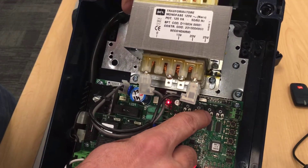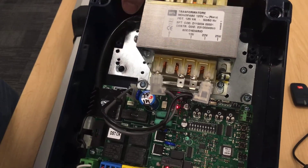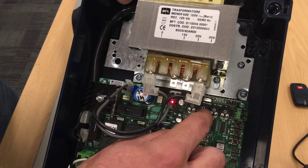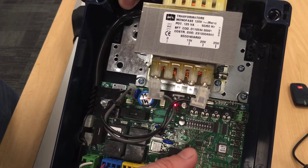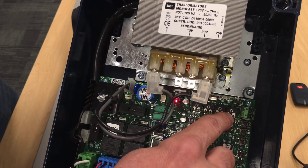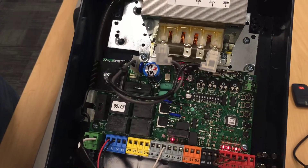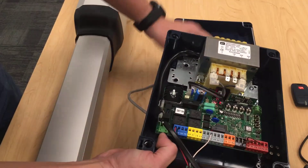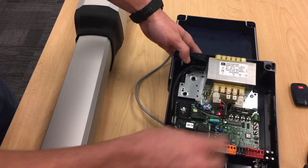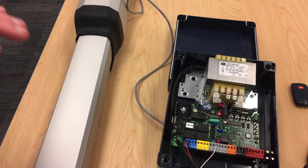Potentiometer number three is your slowdown distance. I normally have this all the way off — counterclockwise — to make your slowdown distance the shortest. Potentiometer T4 is how you go between leaf delay or making it one motor. If you just want to use one motor, like our demo, T4 is all the way off. If you want to use two motors, you would turn T4 up to at least 9 o'clock. If you have it below 9 o'clock, you'll still get only one motor working.